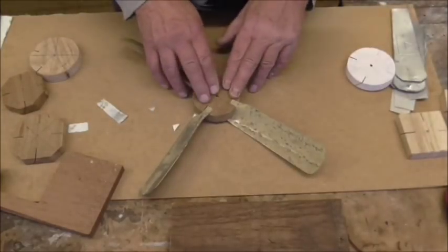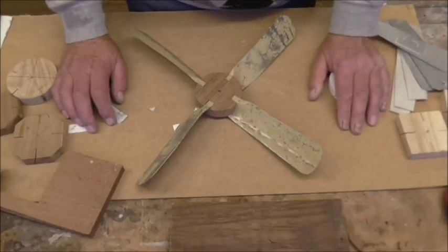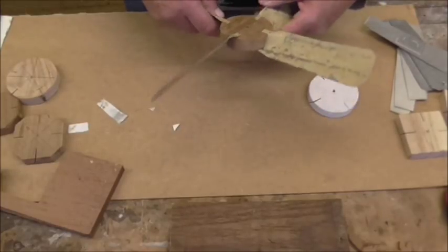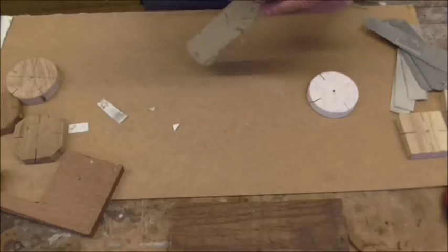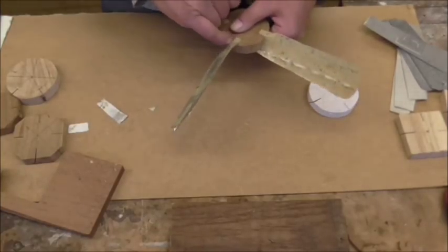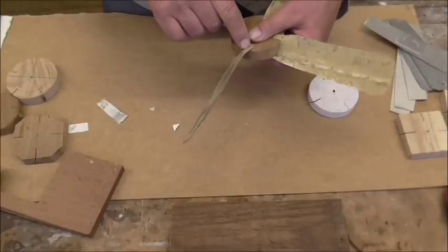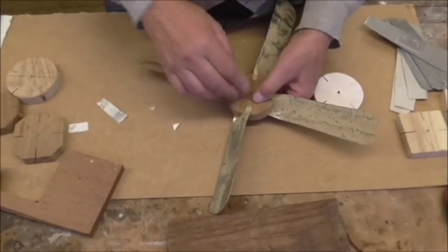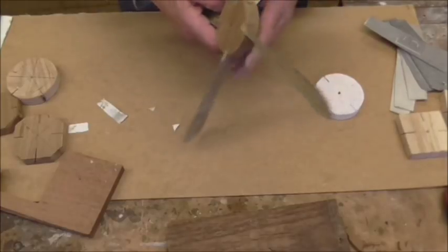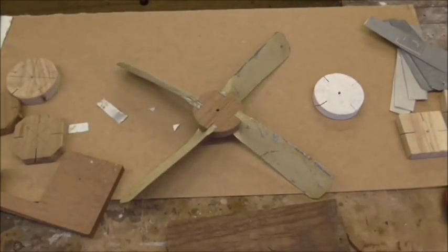Once you've done that, I get some white acrylic undercoat paint and put a bit on around the wood, then let that dry. Sometimes I then use something like No More Nails acrylic filler in a gun and poke some into the little gaps to seal them up. Because you're putting these out in all weathers, rain will tend to get in and spoil the paintwork, so sealing those holes is worthwhile. I didn't used to do it but I find it's better now.